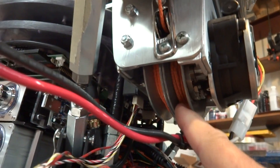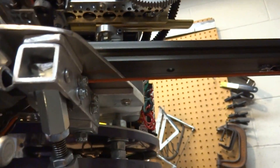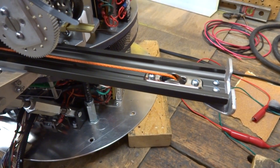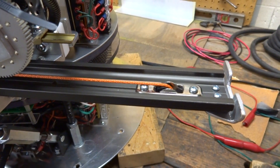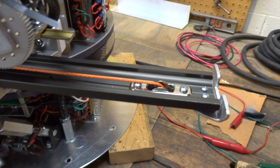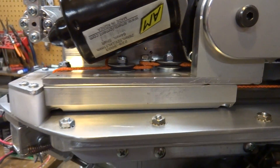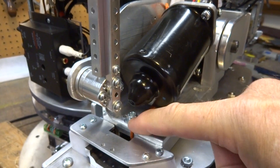You can see I have a synthetic cable — Vectran, I think it's called — it's got a Vectran core that comes up either way, the front and the back, and goes through and goes over these deck dollies or blocks that I got from Harken. That's the stuff that miniature sailboat RC hobbyist guys use to handle the sails on their yachts and boats. Then I attached it in there, came up around the back. You can see I have it around the back of the carriage, and I kind of rounded that really nice so I wouldn't dig into the cable and ruin it.